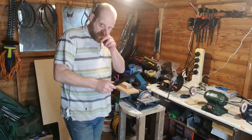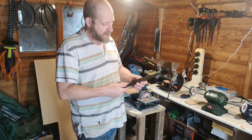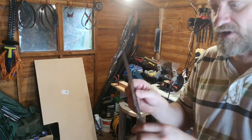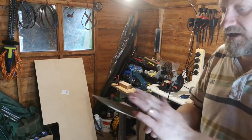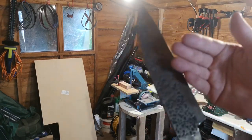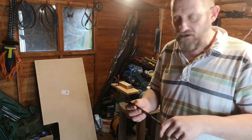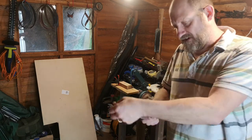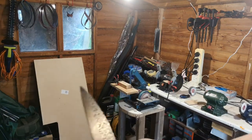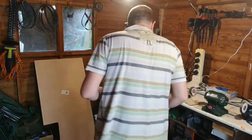This one is for the bearded chef. I'm going to set up a wooden jig for this as well. Because of the shape and it being a chef's knife, I want a very shallow grind — probably about 4 degrees on each side, giving me 8 degrees total, and that might even be too much. I'll test it on a piece of metal first before using this blade. It's a shame because the heat treated color looks really nice, and it heat treated very well. This is 1080 steel.